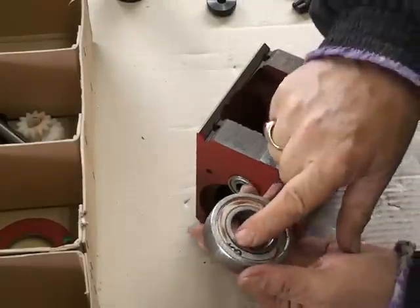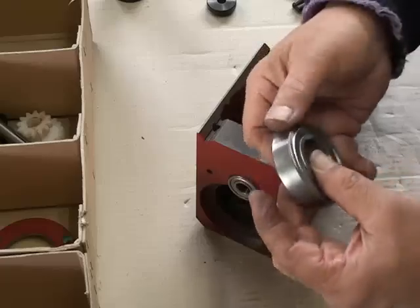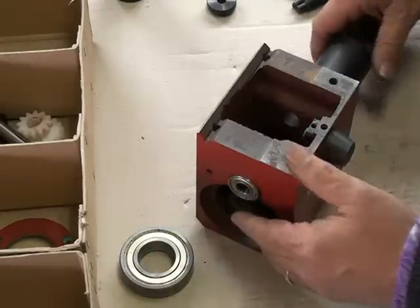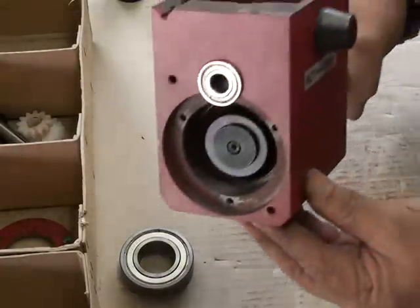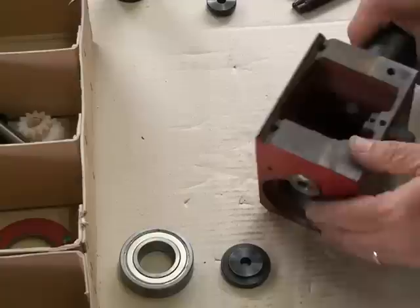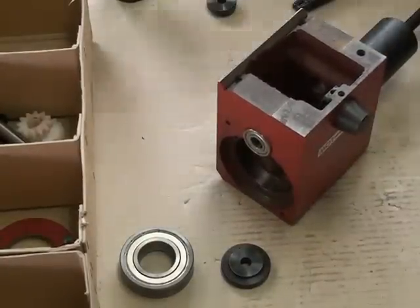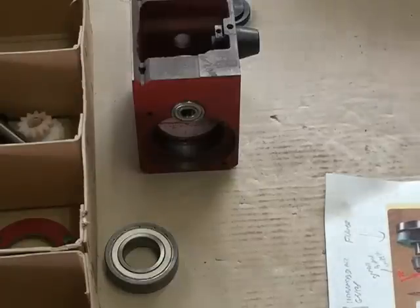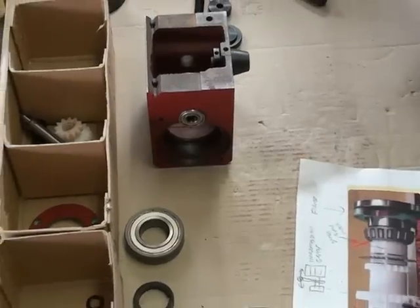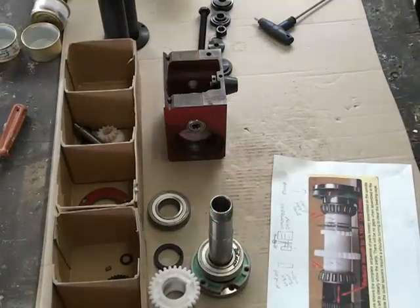I had already marked the outer flange. That's the inner flange - the bearing has come out. You can see the washer, and the threaded rod will now be withdrawn. The next step will be to remove the bearing off the spindle and start putting the new bevel bearings on.